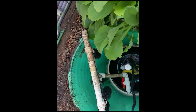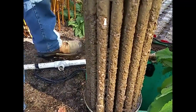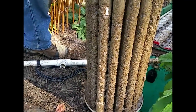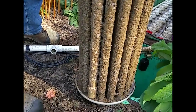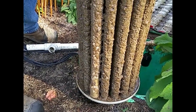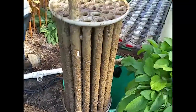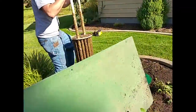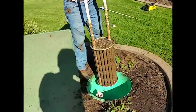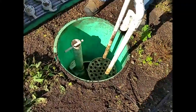He's going to set that back in, but actually we've got to pull the vault first. Cass is pulling the BioVault — this one's pretty nasty. If we hadn't cleaned it, we'd probably get screen cleaning alarms on this system. So we're going to take it over to the septic tank opening on the other side of the tank and spray it off down there to get it clean.